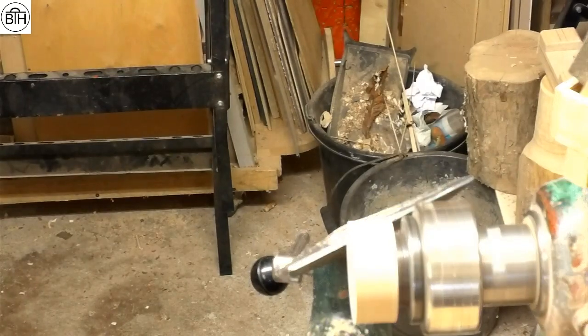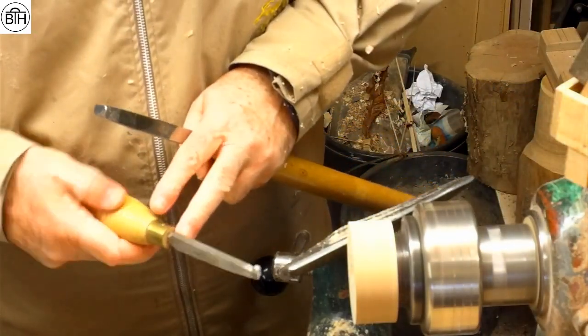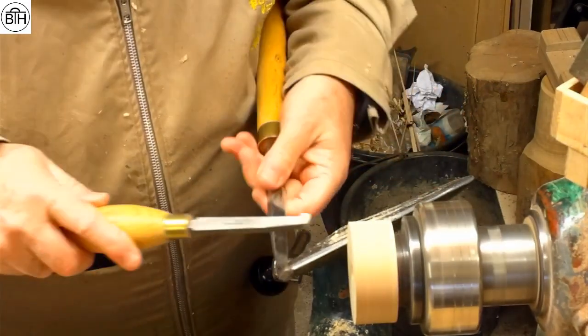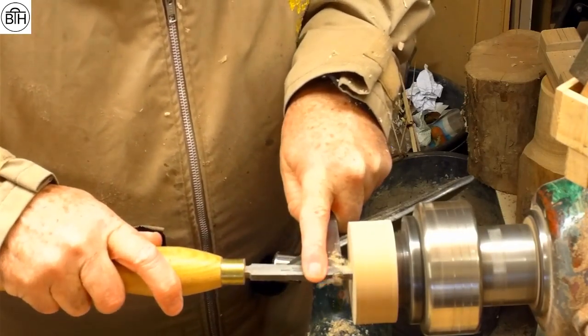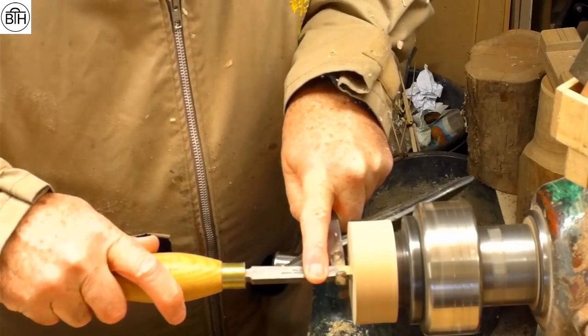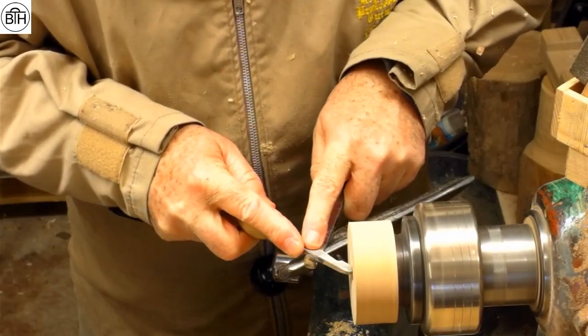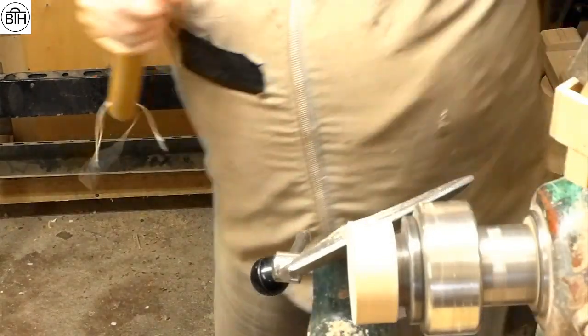And then the next tool I'm going to use is to make a groove at the bottom of the hole we've made. And the tool I'm using is this one. This little cutter is going to go in that way, and I'm going to pull it into the hole. It's at the bottom of the hole now. And that will just give my thread chaser somewhere to go. The other thing I want to do is just put a little chamfer on here, and that will just give us a bit of a lead in when I come to do the